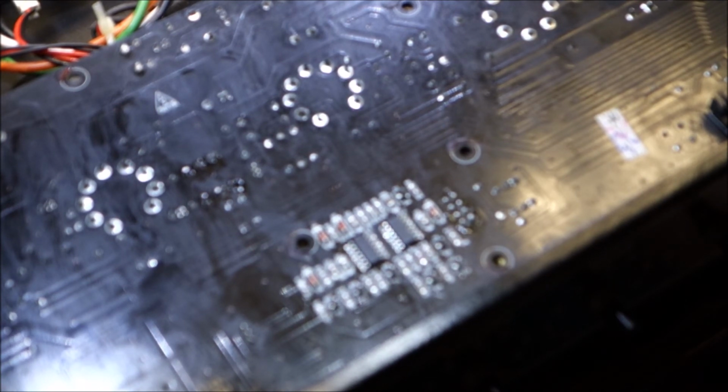Okay, so while we were talking about it, he's like, well, how many volts is that module even getting? I was like 3.8 and minus 15. He's like, well, where's your plus 15 or your plus 10? Because it's got a 5-volt regulator, and that needs to have at least like 7 or 8 volts to run right. And I'm like, I don't know.